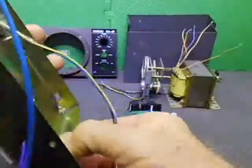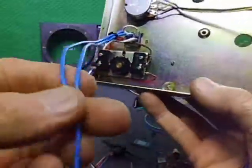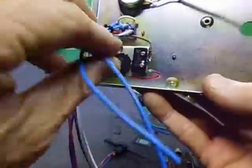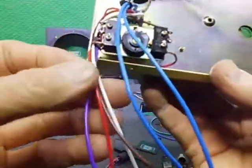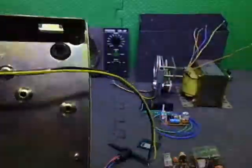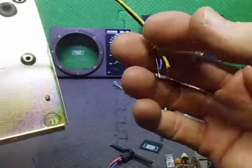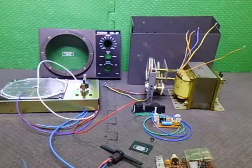I've rewired using Australian standard wiring since this is 240V into the switch — neutral goes through the switch and the active goes through the fuse. I've tied the wires down here to prevent stress on them. The original wires were very rigid, coarse-stranded, and not very flexible, so I've replaced them with better wiring throughout.